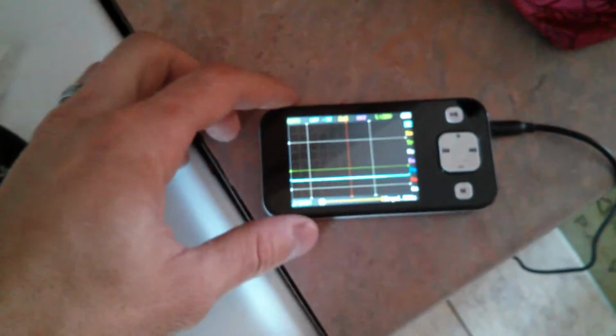Nope. And that's that. I tried starting up again once, but this was locked rotor, so there was no power. So now, the only way I'm going to get power again for the next few minutes, whoops, there's no light down there because there's no power, is by shutting the fridge breaker off, which is... I don't know, one of these.